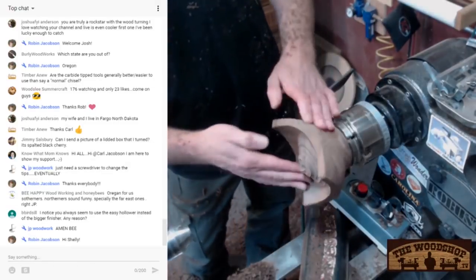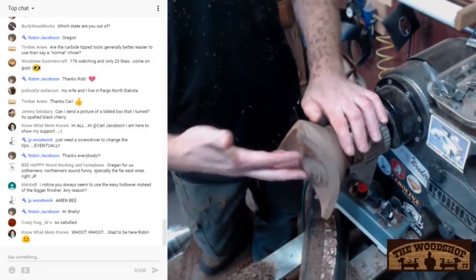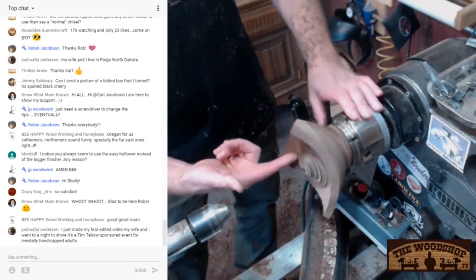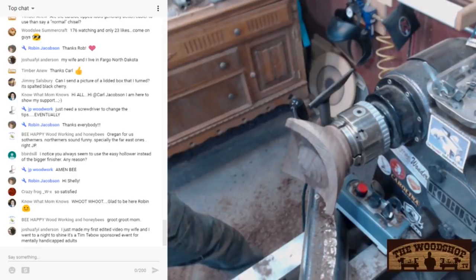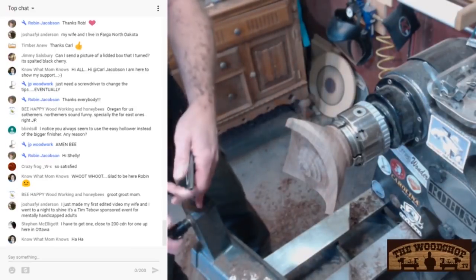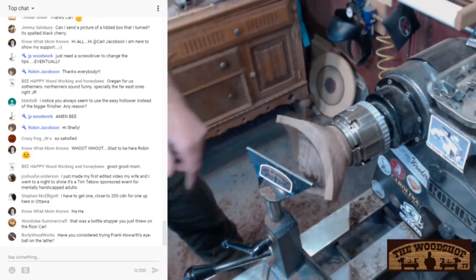Yes, especially for doing the insides of bowls, if you're just turning green wood and trying to get out the majority of it, I'll use the big one. But what I find is when you get down to the bottom, coming across the bottom and then to the side where it starts to come up, it's much easier to use that little teeny cutter. The bigger one seems to grab a little bit at that one little point, and you don't want to have your bowl down to thickness and have it grab all of a sudden. So I always use the little one. To be honest, if it's green wood, you can take out a lot more material faster, but you can see how fast it's going.